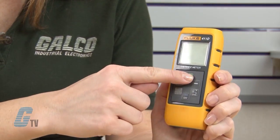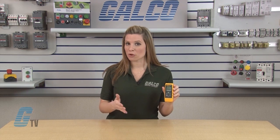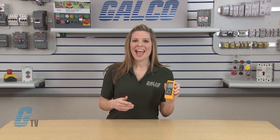To power on the distance meter, press the measure key. Next, I will set the measuring plane to either be configured from the front edge or the rear edge. The standard setting is the rear edge. For measuring from the front edge, I will quickly push the unit key, and the distance meter will then measure distance from the device's front edge.